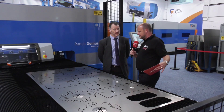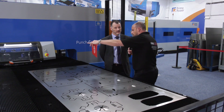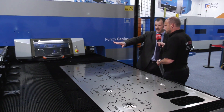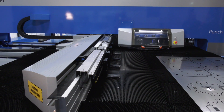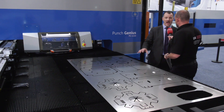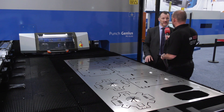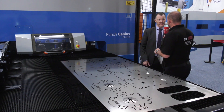Tell me about accessibility here - standing right next to the machine it does seem very easy to work with, very ergonomic. What about the hardware and whether this table moves backwards and forwards? You've got your clamping axis there - you can see the clamps - and incidentally they will actually move as well if they're in the wrong place on the sheet; they can reposition during the process. This table will slide back, so if you're loading a shorter or narrower piece you don't have to have the table at full extent. There's a handle to move the table backwards and forwards so the operator isn't having to lean right into the clamps to load the part - he puts the part into the fingers, the fingers clamp up, and the process starts.